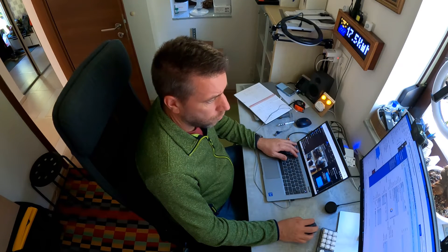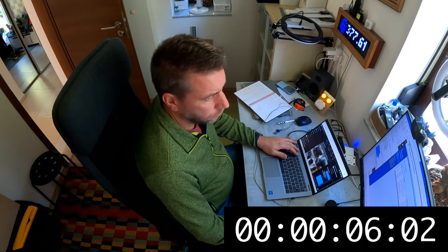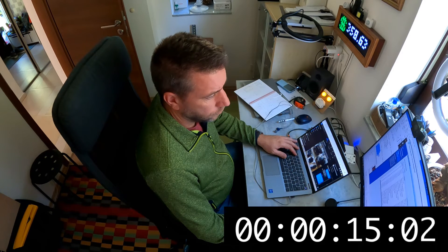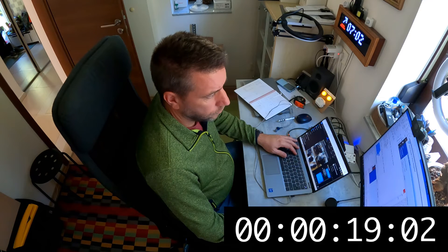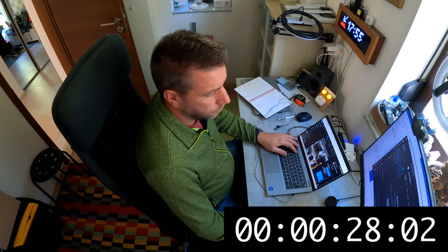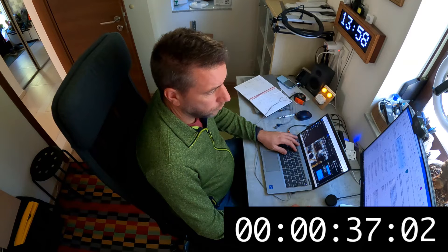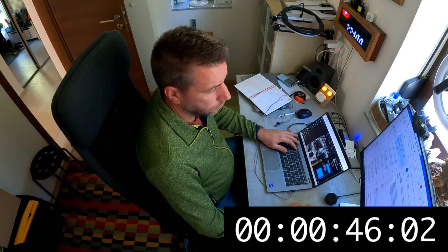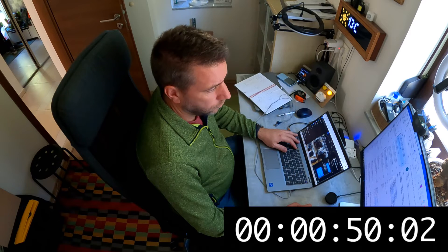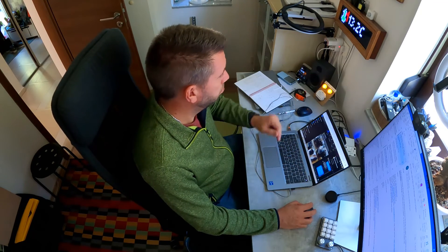The first test was sitting very still in my office, just looking at the screen and checking emails, only using my right hand to operate the mouse and scroll the wheel. When I was this motionless, the PIR sensor turned off after 50 seconds. But over many days of using this setup, I never once saw the radar sensor turn off. At this close distance it can apparently pick up my breathing — my chest going up and down — and that is enough to detect presence. No matter how still I was, whether watching something or listening to a conference call, it still showed me as present. For small rooms where you can place the sensor close, it reliably detects presence and can keep the lights on.